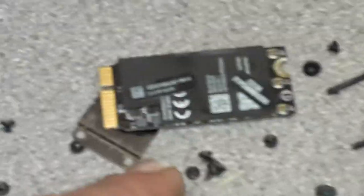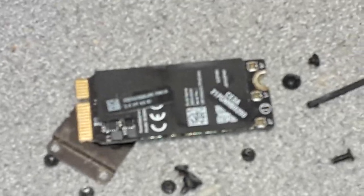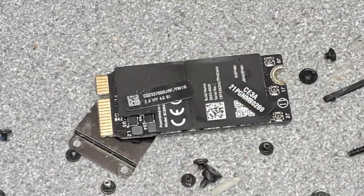By the way guys, I forgot to tell you something. Every time you're gonna clean a board, remember to remove the shields. Remove the stickers, see that? The serial number, the model number stickers, you see? Remove everything, guys, you don't want to make things worse. I'm gonna have to clean this thing as well. Now I'm going to have some smoke.